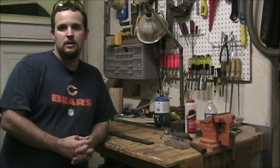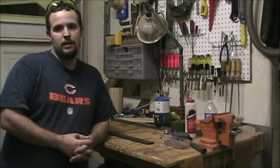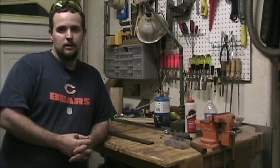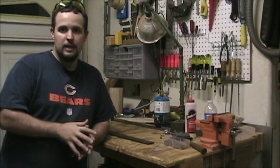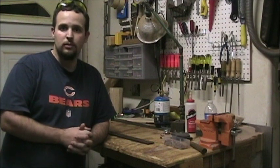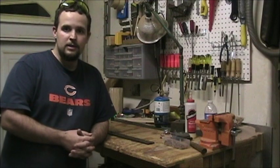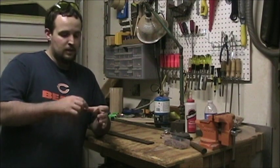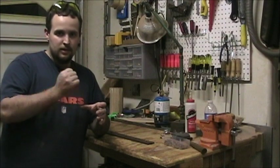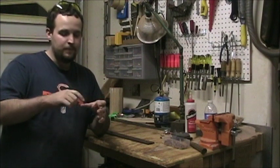The Six Gun Guitars electric bass build is in progress — the fretboard is already dug and tapered. Now it's time for inlays. I've selected three-eighths inch plugs cut from padauk — basically little padauk dots going all the way up and down the fretboard. I took a plug cutter, mounted it in the drill press, and went down into a piece of padauk a whole bunch of times, digging out about one-eighth inch deep plugs.